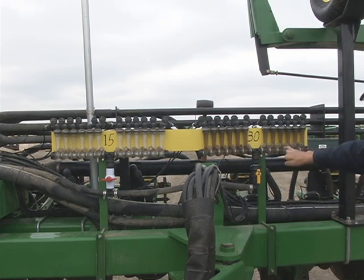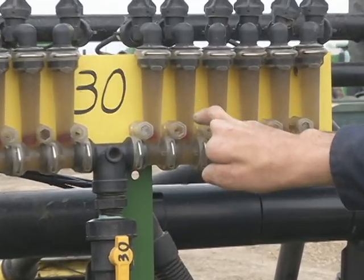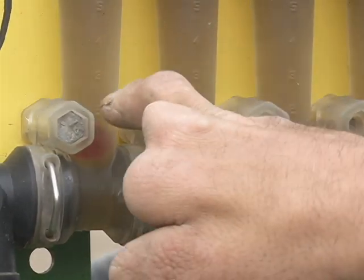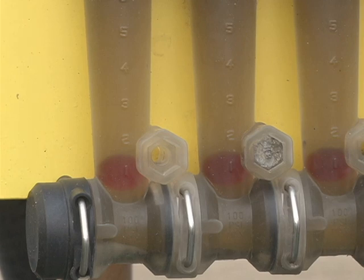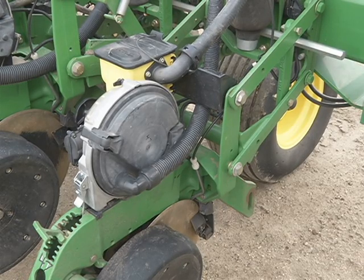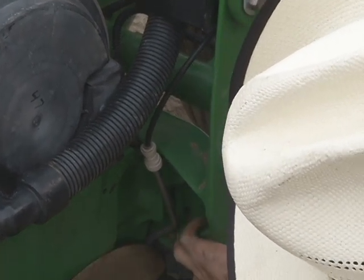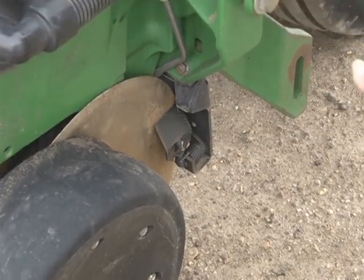As you're going through the field, you'll see these little red floating balls. These little red indicators will rise and kind of shake and shimmy inside here, letting you know that there's product flowing through and getting diverted into each of the individual row units. So once auto steer is engaged and you have time to pay attention behind you, just take a look back and make sure you see a little shimmy and shake with each one of these red dots — that tells you there is no plugged line and that you are applying product to each individual row unit. From the diverter plenums, the liquid product is diverted down individual tubes into the row units, attaching with a slip fitting onto a steel tube that is bent precisely to empty out right next to the seed tube, placing your starter fertilizer or insecticide right next to the seed.